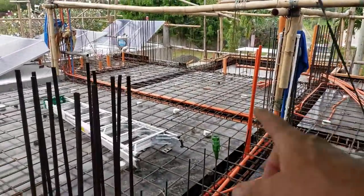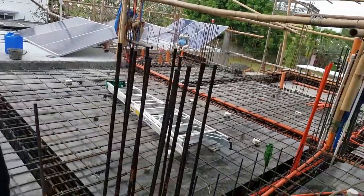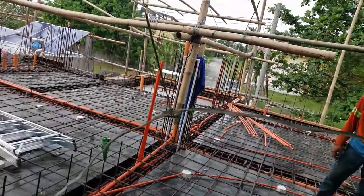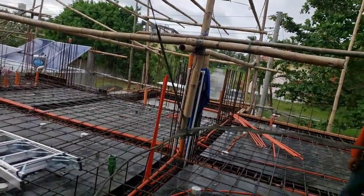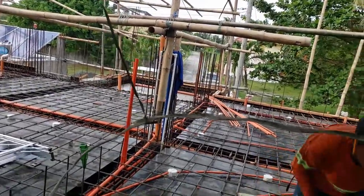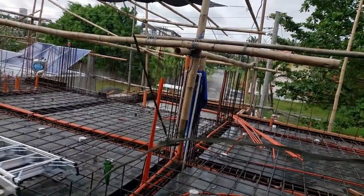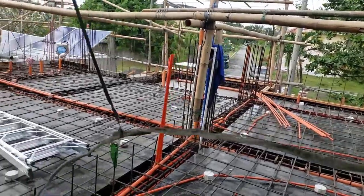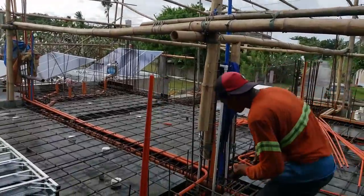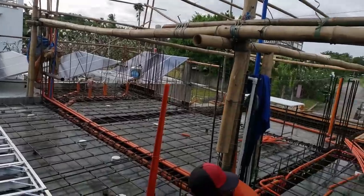And that's them sticking up because I want it easy to be able to pull coax through, and I want it easy to be able to pull power wires through. In case of some different technology or additions later, I want to have room to pull some wire through. Maybe I want two sets of wires coming through that conduit. I don't want wireless cameras. I want hardwired cameras.